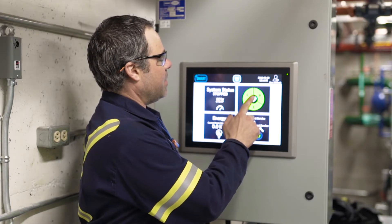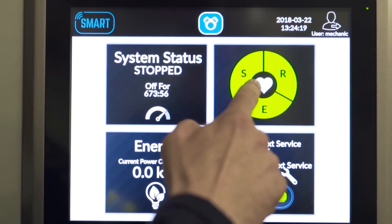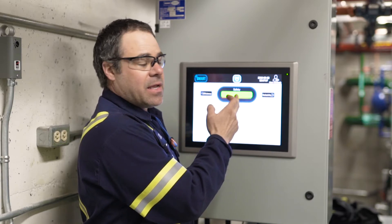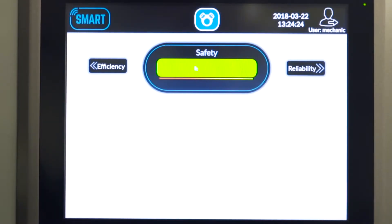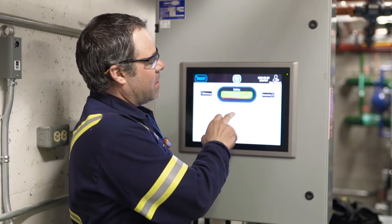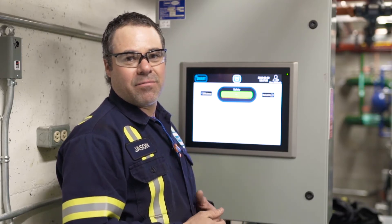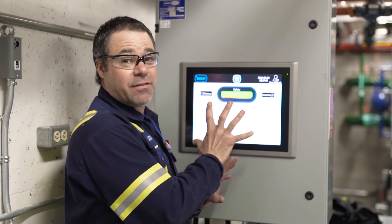So we're going to start with the safety, reliability and efficiency — this is the heart of your system to monitor and let us know what's going on. In your safety screen, you'll see that if there's any issues, this bar will slowly start to come down, and it won't go back up until you've actually manually reset something here or written it down in the logbook. If you've got a low pressure cutout, high pressure cutout, or high oil temp issue, it'll come up here in the screen individually. Before, you had to go in there and reset every single switch manually, where this is going to tell you exactly which one you're resetting so you can log it — and it's also logging it for you.